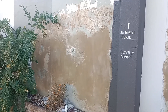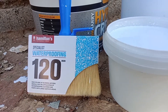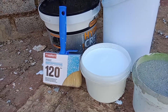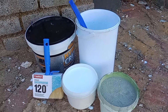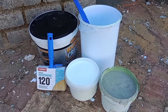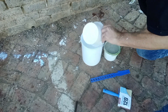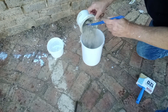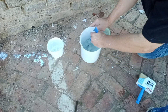We are now going to apply our waterproof cementitious slurry using a Hamilton Specialist waterproofing brush. The additive is a cement-modified synthetic latex additive for cement and mortar mixtures. We mix it equally — one part latex to one part cement, basically one litre each — and blend them together, stirring thoroughly. We're mixing the synthetic latex additive with our cement equally, adding slowly then mixing, adding more, until we've got a kind of PVA consistency, and then we will be ready to apply.